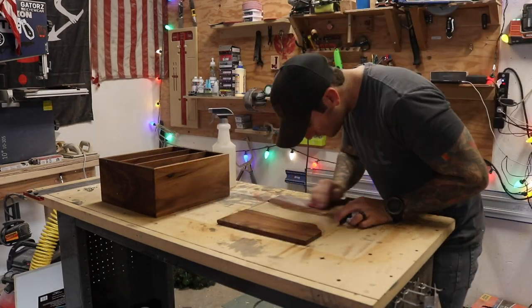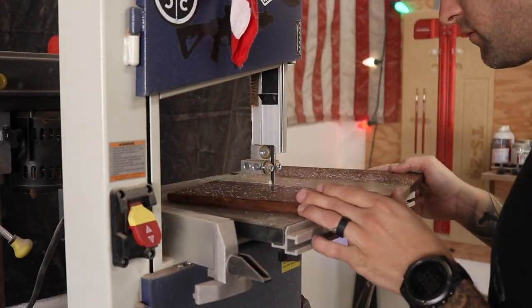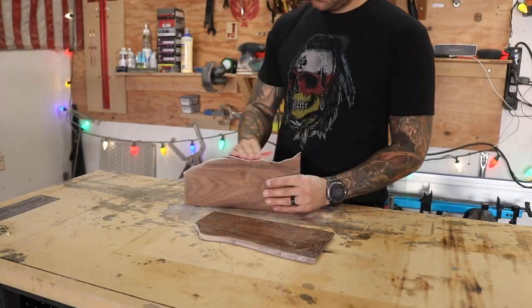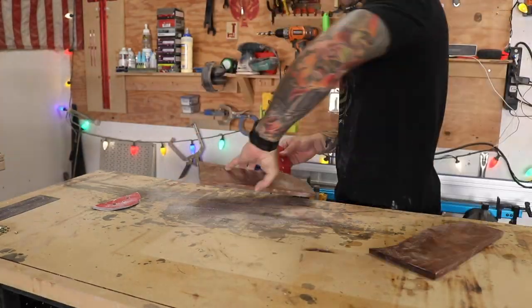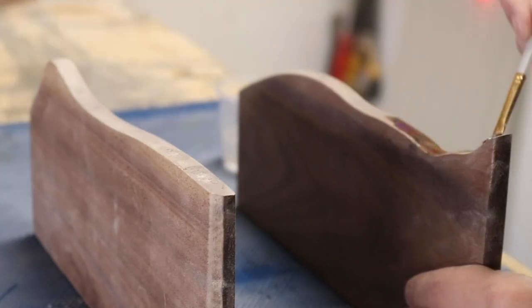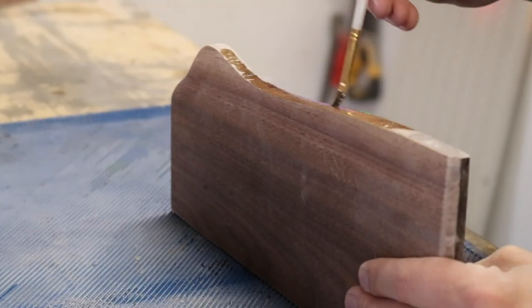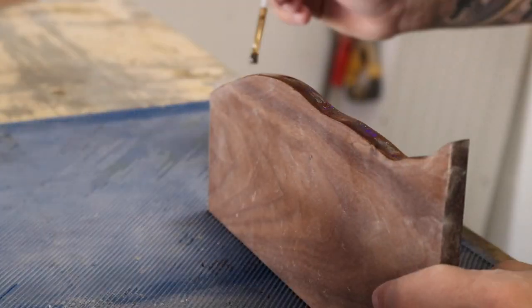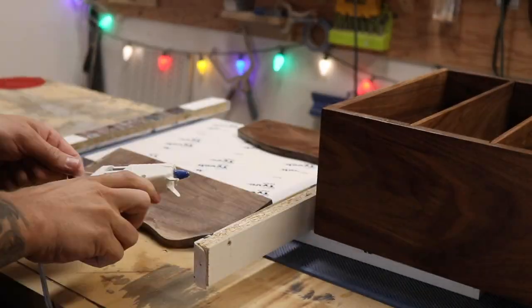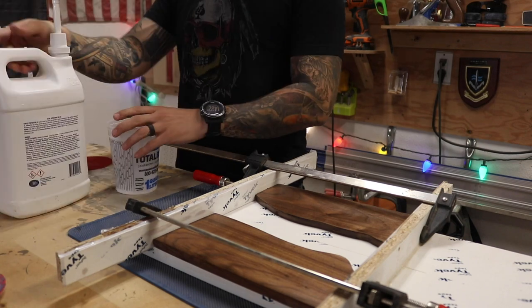I reached out to my buddy on Instagram, Homegrown Creations — he's from Arizona and does a lot of half-wood half-epoxy boards. He told me I should seal the end grain with a clear coat of epoxy, let it dry, and then do the pour, and that should stop air from escaping from inside the wood into the epoxy. That's what I'm doing here with a paintbrush and one pump of each to get a small batch. Since I had already trimmed the lid to length, I lined up the box next to the mold and then lined up the top and bottom with the edge of the box so I had the same amount of epoxy coverage. On this pour I decided to add a little titanium pigment — I'll link it in the description.